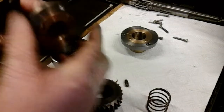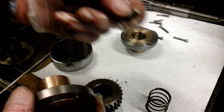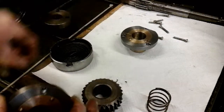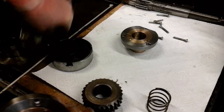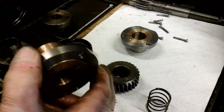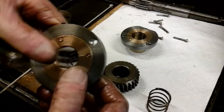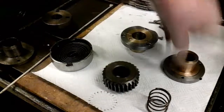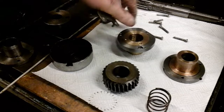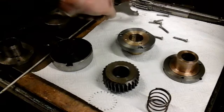Where before somebody put this pin in - and it should have had a keyway - I'm doing away with that pin and going back to standard, so that the handle on the fine feed is horizontal instead of at an angle, as I showed you in part one. So I've done both sides now and it's ready for being assembled and putting back together.